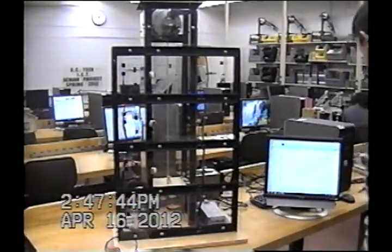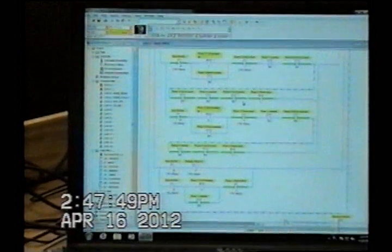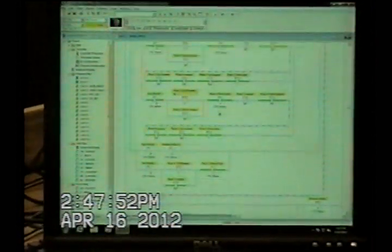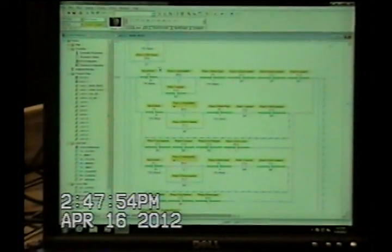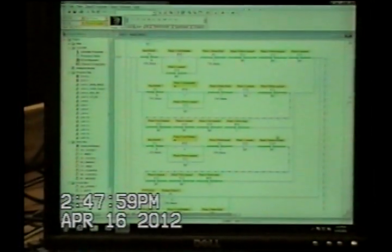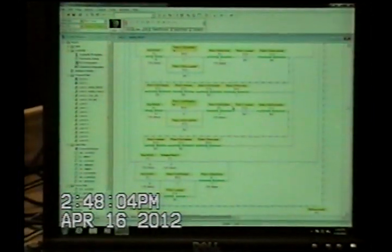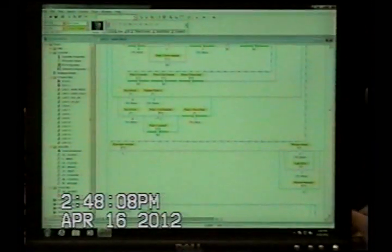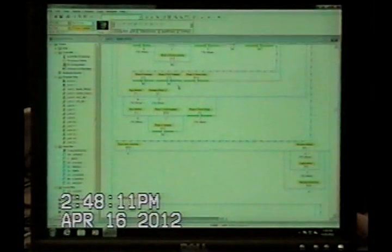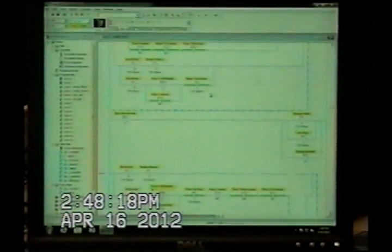Here's a bit of the programming. This is the down branch — first floor, second floor which comes all the way down here, third floor, and fourth floor doesn't go down. Here's the home part, the jog, and so on. There are a lot of lockouts that were done to keep it so that it could go back and forth between the floors.